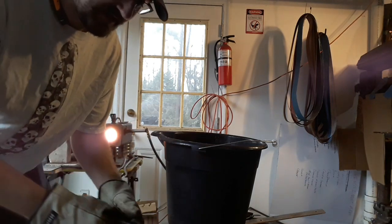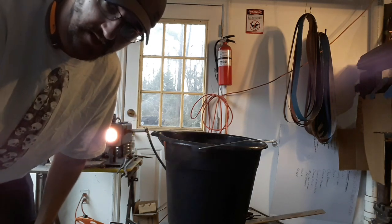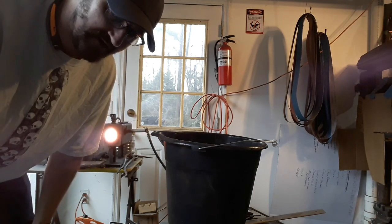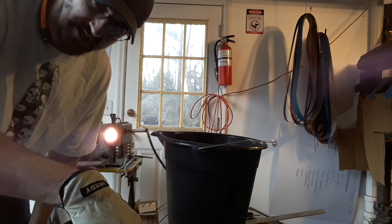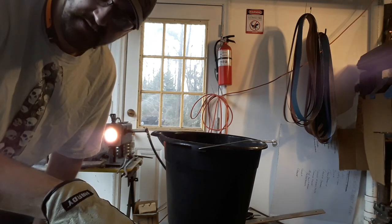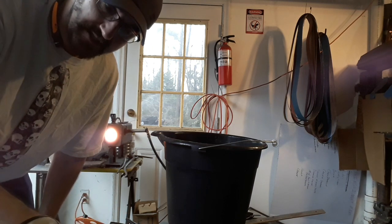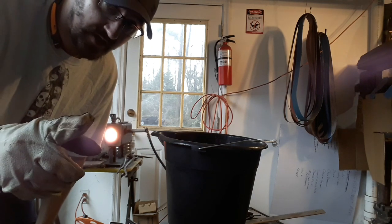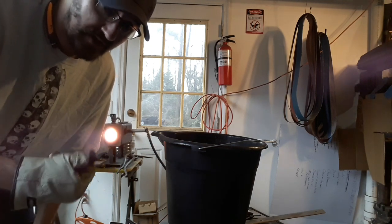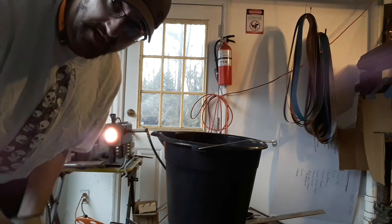This is supposed to be from a machine that cuts apart 1,000 PSI paver stones, so I know the steel on the blades is super tough. This came from another part, but I was told it should be the same steel as the blades. We're gonna find out. I water quenched some of the blade, and it made a really nasty grain, but it also hadn't been normalized a few times before it was quenched. I know that stuff will oil quench good, but we need to find out about water. So, I'll be back in a minute.